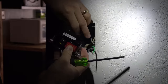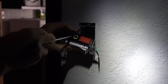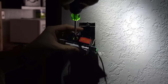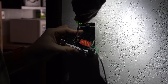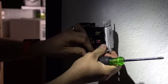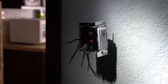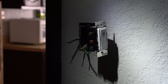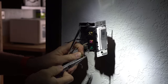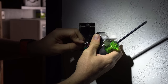The load wire goes over here — all I'm going to do is stick that in between. There's basically a plate in there that squeezes the wire between the switch piece and the plate. Get that nice and tight and the switch will actually hold itself. The ground doesn't have one of those clips — you may actually need to take your pliers and rig the ground wire a little bit so you can get it around the ground piece and it holds in place.